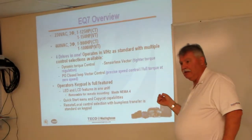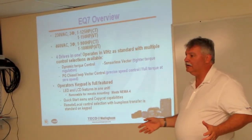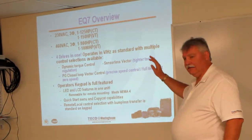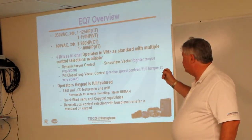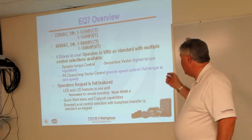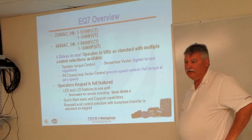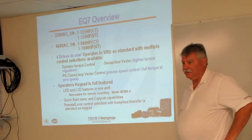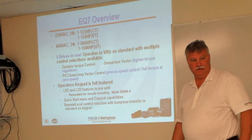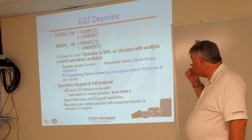The drive has some other capabilities, including dynamic torque control. If you have a hard starting load or something with higher inertia that needs an extra kick to get moving, we can set that up. If you have applications that require feedback or high current response, we have motor control modes that will solve those applications well. With Teco Westinghouse, we're looking at the larger world of controls — both industrial, commercial, and climate — so that's part of where we're marketing this.